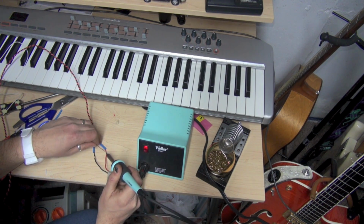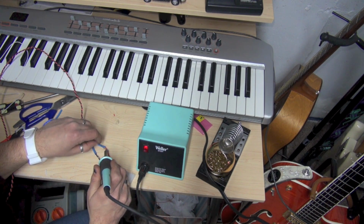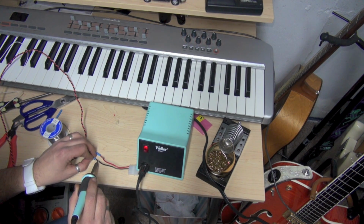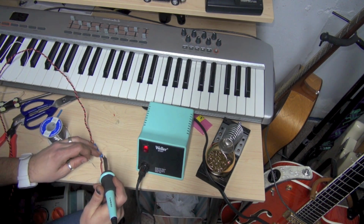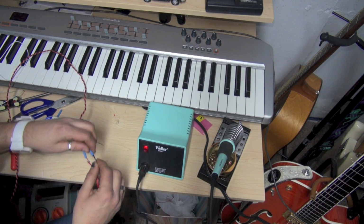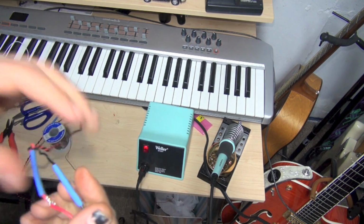And, you know, I'm heating up the wire first and then touching the solder to the wire, and hopefully our heat shrink tubing will fit over this mess that I'm making on here, because that always sucks when it doesn't. I could have probably pulled the pins out of this Molex connector instead of doing it this way, but this is quick and easy. So we're going to put our heat shrink tubing now over. Hopefully it'll fit. Probably should wait a little bit, let it cool off, but alright, so we got that one over.